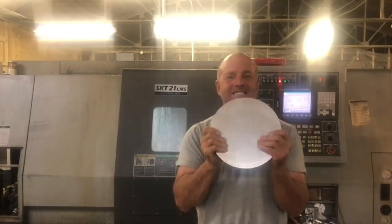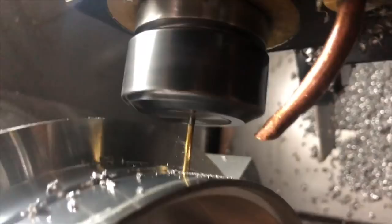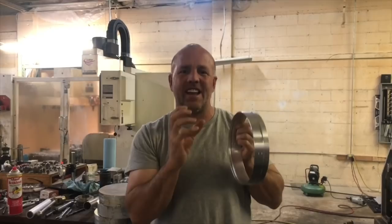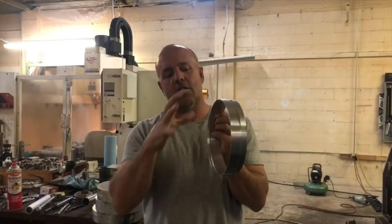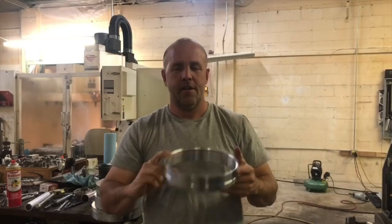There's the first light ring done. It's got the pre-drills for all my nut plates. There'll be another ring that goes on here, inside real close. The little tiny steps are designed exactly to the light so the light will snap in. Then the cover ring will go on it, and it will also hold a plexiglass dome I've got to make. So I'll have a rounded face, the light, a ring — and this part will be riveted to the carbon fiber that ties into the wingtip. Three more to go, and we'll get back to carbon fiber.